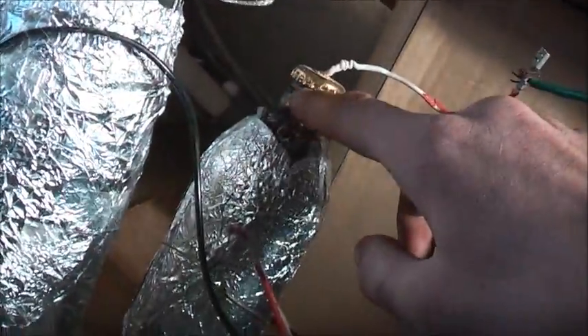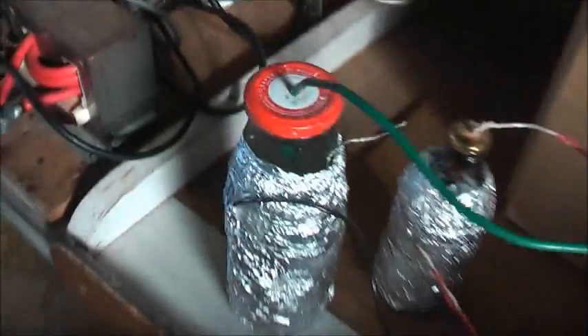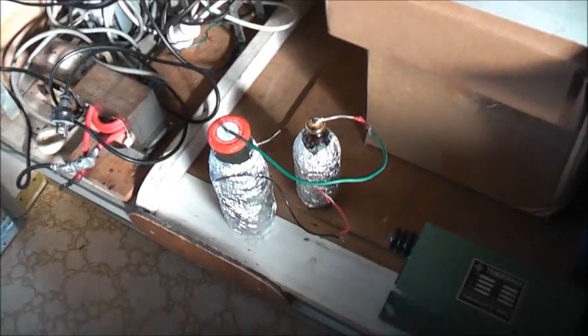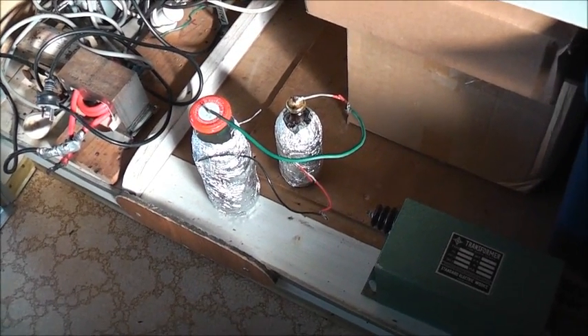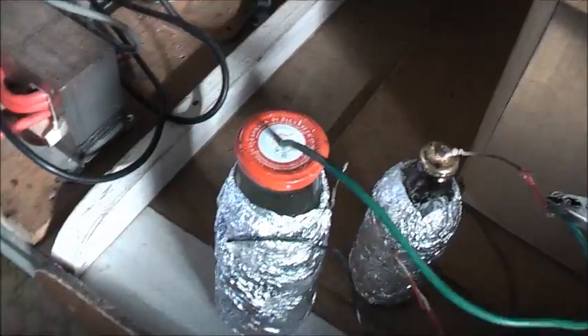You can see where the arc drew and it actually melted the glass. I had these in series but didn't get much of an effect. Put them in parallel like this and boy did I get a thunderstorm — literally just awesome. Alright, let's plug it in and give it a test — listen to some snappy thundery lightning arcs or sparks.